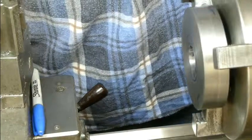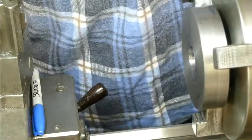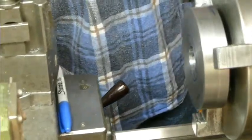You'll notice, I don't know whether you can see the back plate, but the back plate is bolted to the chuck, and by loosening the bolts you can actually move the chuck on the bolts. I did that some years ago to get the best run out I could.